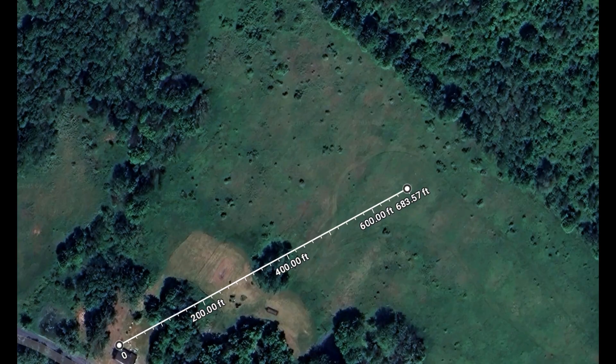This thing does seem to beam it, and it beams it the other direction all the way down to the highway, which is well over 700 feet. The only thing I cannot figure out is that mesh repeater mode — I can't seem to get it to stay in mesh mode. I have to use it in repeater mode, so it's creating another network with a different name, which I really didn't want. I kind of wanted it all to be one network with the same name, but I can't get that mode to stick. It gives me some options for other things I can do with Wi-Fi way up in our fields.